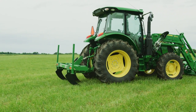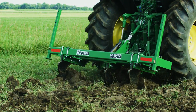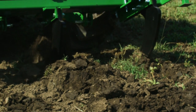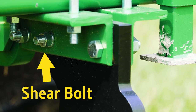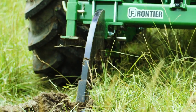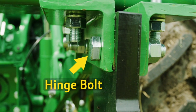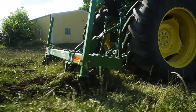There's really nothing subtle about this kind of project. We're dragging heavy-duty, heat-treated steel shanks through this hard, compacted soil — and who knows what might be underneath. So each shank has a shear bolt in case Jermaine hits a big underground obstacle. In that case, the shear bolt is designed to break, allowing that shank to rotate back and up using the other anchoring bolt as a hinge. That way, it prevents further damage to the implement or to the tractor.